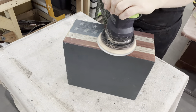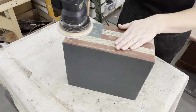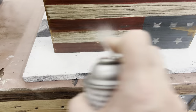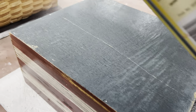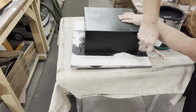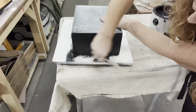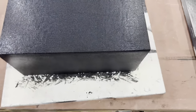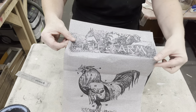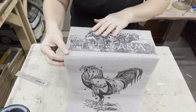Next up is this four-section cubby — yet again one of the Americana pieces. I'm going to go ahead and sand off most of the paint that I can, so there's no texture underneath the paint or decoupage paper. Because red likes to bleed through, I'm going to seal this in with some shellac and leave the inside as that natural wood it already is, then go in and hand paint the rest of this piece with black. Once my black paint is dry, I'm going to seal the whole entire piece in using some polycrylic. I'm only going to be putting the decoupage paper on one side — the top of this other section — and this is actually a half section where some grain sack striping came on perfectly on the front of this.